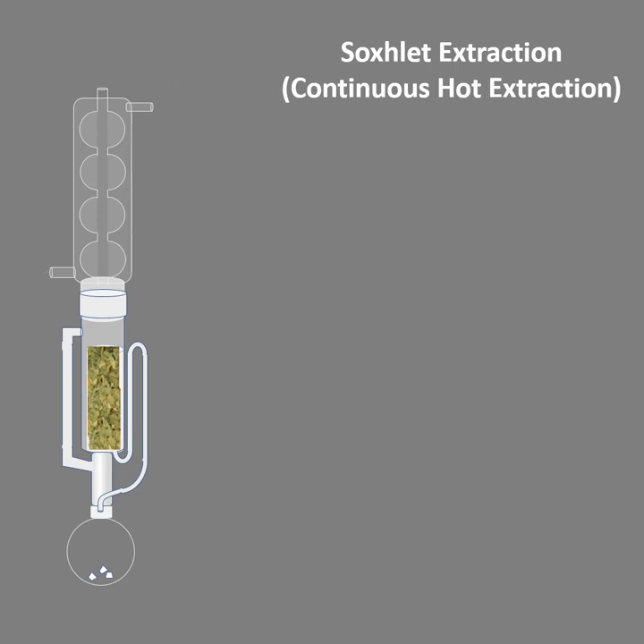After setting up all the assembly, the last step is starting the heating mantle. Check whether the heating mantle is working and warming the RBF. Initially keep it at 60–70 units. Note that the points on the heating mantle do not indicate temperature — these are just the number of coils activated, or you can call it the rate of heating.